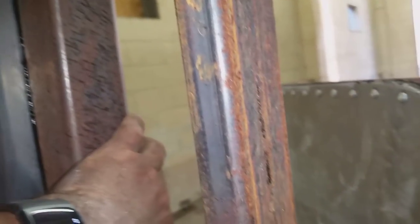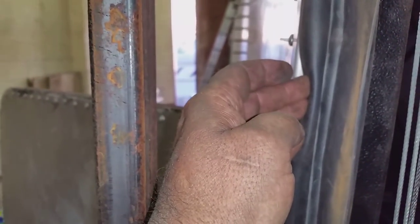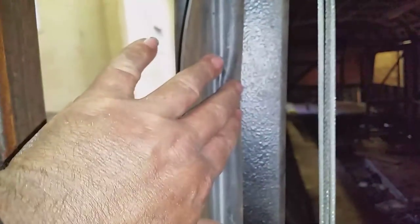There's the seal on there. The outside edge - the piece we were looking at before - will come up against this seal here when the slide out is in. When it's out, it'll go up against this bulb here. There'll be the same kind of lip on the slide out surface, and when it comes out it will contact here. When the skin's on here, this wiper will wipe the moisture and seal it as it's sliding in and out.